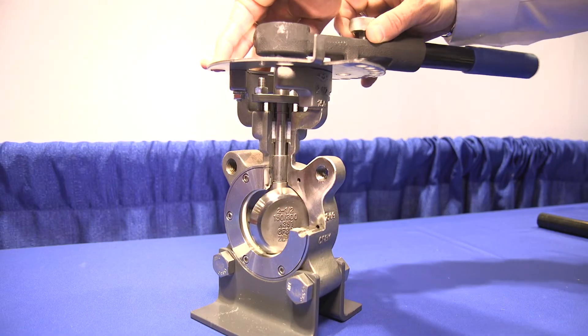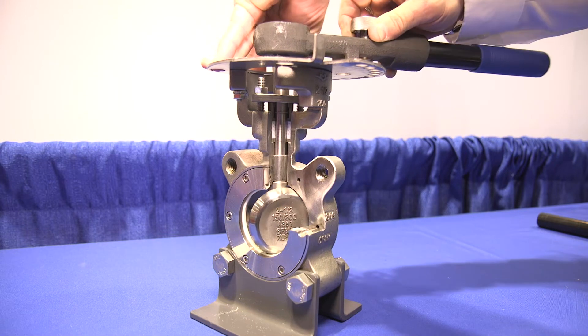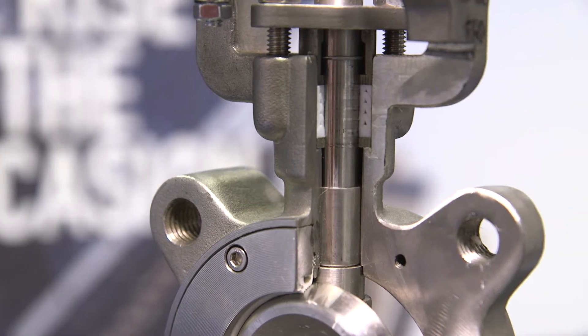In order to provide the best reliability, the valve's construction incorporates a one-piece shaft and disc for maximum strength and flow rate, an internally cast position stop on the body to maintain optimum disc seat contact and prevent over-travel, and a welded taper pin at the stem connection which increases strength.